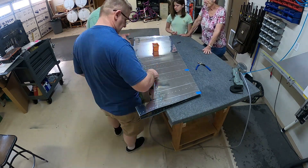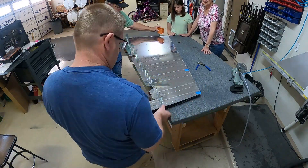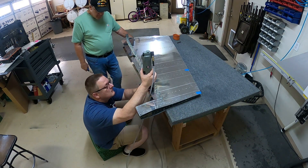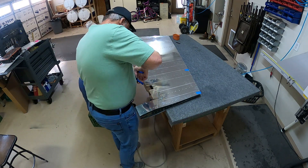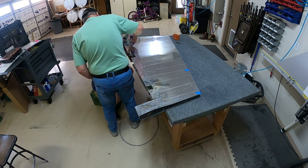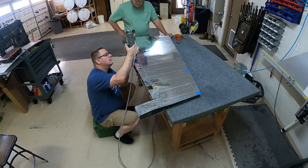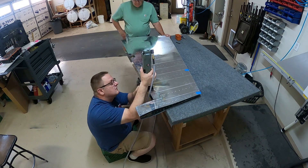So there we turned it over. Basically you click-go every other one, put all the rivets in, squeeze them all, remove all the click-gos, put all the rest of the rivets in. This section is kind of boring, not a whole lot to it. I have my makeshift chair there — I do need to get a better chair. I found that sometimes you have to get pretty low, so I'm going to look at maybe finding a chair that's more comfortable than a milk crate, but a milk crate works.